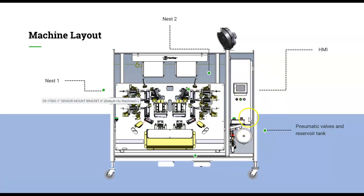What I did was I grouped my HMI, my switches, my controls because there were only a few of them. I decided to use a 1769 controller — I know I have 16 in and 16 out, so I have plenty of IO, but it wouldn't be enough to cover my two nests. So I counted up my inputs and outputs for the left and right nest and noticed I just needed a 32-bit card for inputs on both sides, and I believe a 32-bit output card for each side. So now I've already defined the hardware that I need, the tag descriptions by making my list. I've grouped it so that it's organized in my controller tags database, and I've scoped out my project pretty quickly and efficiently. I hope that this has helped you understand how to scope out a small automation project. This is part of the Logix magazine.